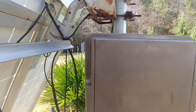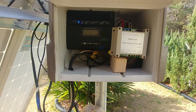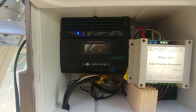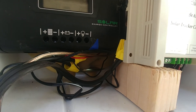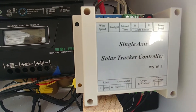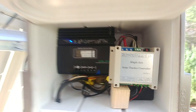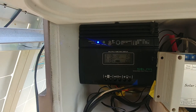The brain of the system that I'm using for this contraption is in this igloo — I use an igloo cooler for housing the unit. Inside here I have a 12-volt AGM bike battery in the back to power the motor, and that's my charge controller and the sun tracker unit that I'm using. I bought this tracker unit and the sensor up there.